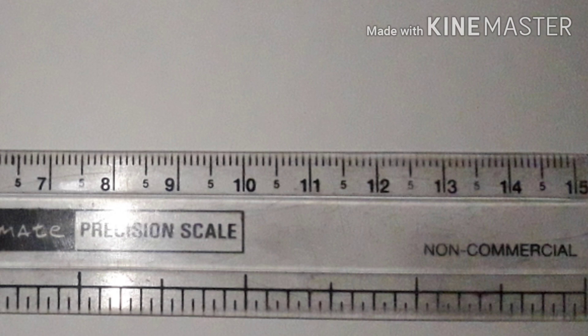For example, if we see a regular scale which is marked in centimeters, you can see that there are 10 divisions between each centimeter. So one division means 1 millimeter. This one millimeter is the least count of the regular scale. If the length of any object lies between 8.1 cm and 8.2 cm, you cannot take both — you have to take either 8.1 or 8.2. That means you cannot measure anything lying in between those values. So this is a problem.